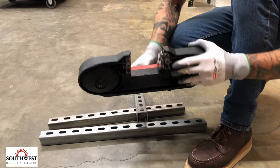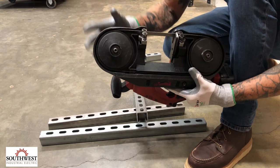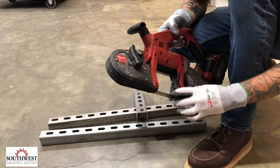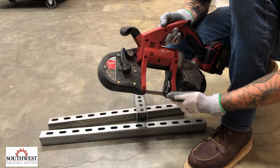Let's go over a couple of areas on the bandsaw. Obviously you have the blade. Bandsaws come in different shapes and sizes with different blade sizes — certain blades are meant for certain materials, so make sure you have the proper blade for what you're cutting. You have the guard going all the way around; always inspect it and make sure there are no big cracks or breaks — it should be well intact. You also have this metal back plate: as you're cutting, the blade drags the material into this piece, which keeps it from moving on you.